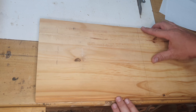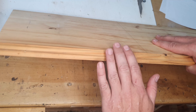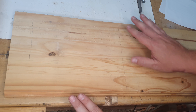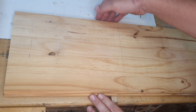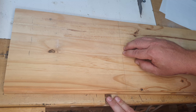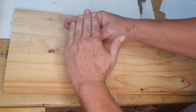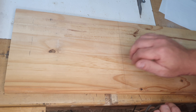First thing I'm going to do is cut this piece on the 30 centimeter line. On the top side it's got a bit of an edge - the option is to leave it or cut it straight. I'll probably leave it at the top and make the bottom side the plain square side. I'm also going to cut the little foot piece - that's going to be two pieces of wood, one upright and one on top as a hook foot piece for the book to stand on.